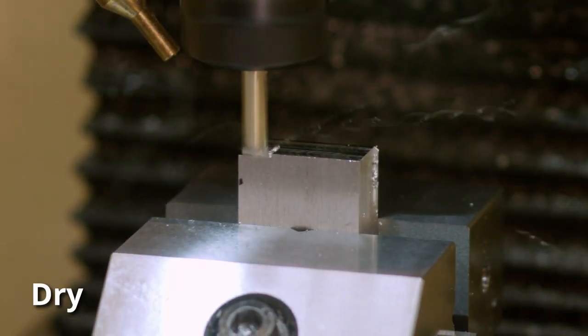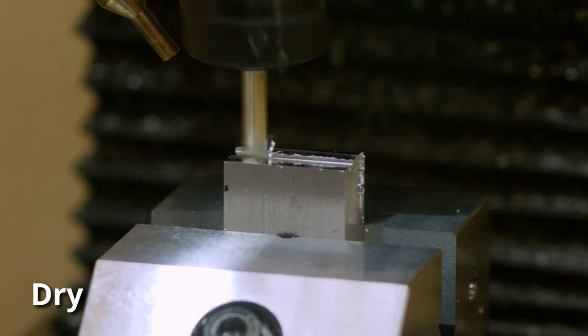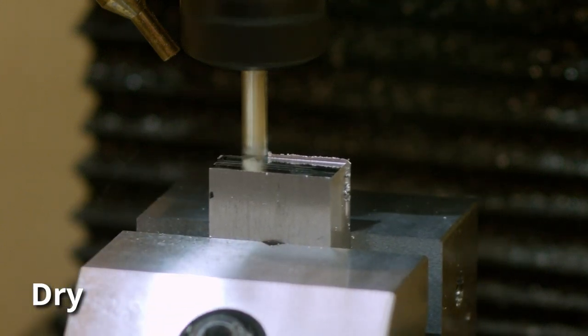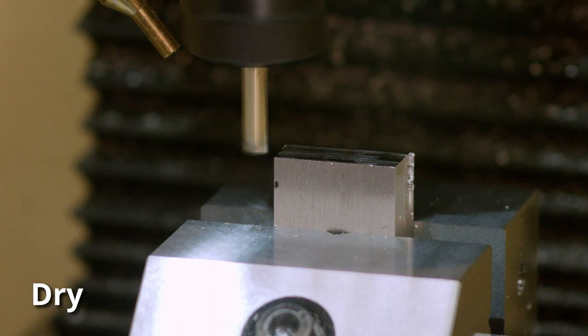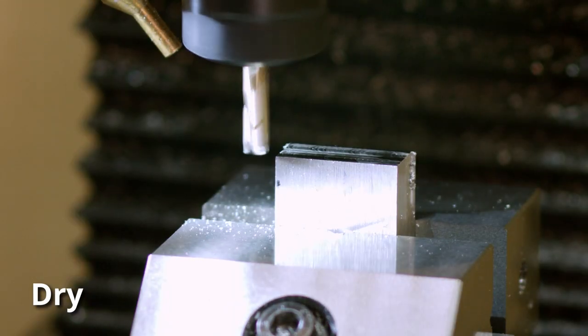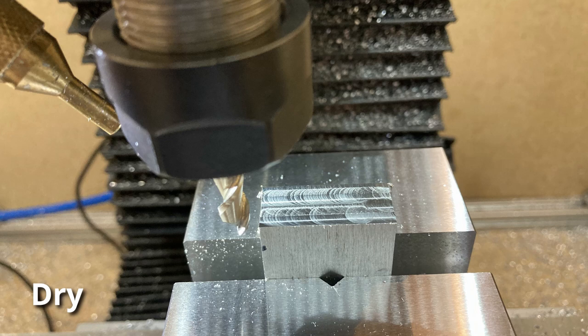This first cut is dry — there is no air, even though you see an air nozzle here, it's turned off. The only air is from the spindle, which is air cooled, so it will blow a little bit of air downwards. This is now the climb pass, alternating climb and conventional milling. You can see from this angle that the surface finish is pretty smooth looking, but there are these sort of circular or half-circle imperfections. To accentuate the problems, I take a flashlight, shine it right at the imperfections, and take a picture. That really shows a very detailed view — worse than what you'd expect in real life — and the primary imperfection is this sort of stacked coin look. That's what I'll be evaluating as we try out the different cutting fluids.